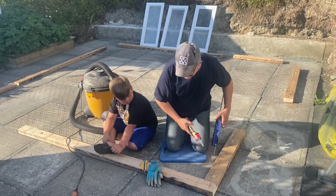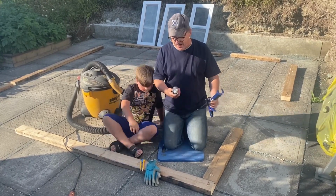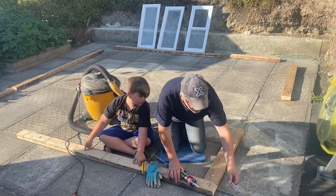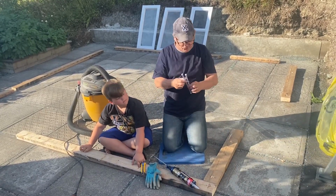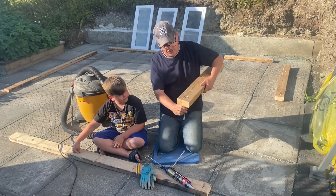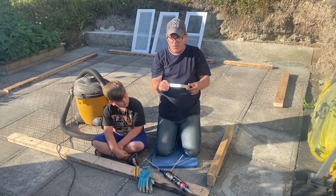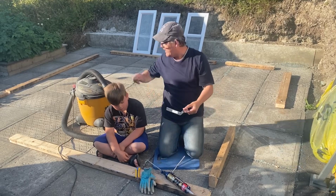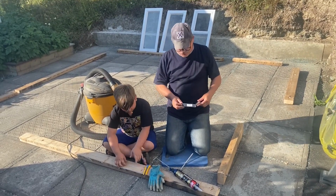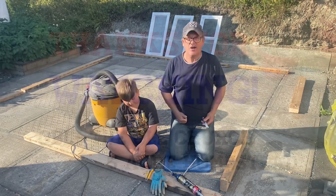To secure this rough 2x4 to the patio stones, we are using a caulking gun with PL Premium. We're also going to use 8-inch lag bolts. That's right. So we're also going to put the 8-inch lag bolts down through these. We've got it countersunk. We also have these L brackets, and we're going to be securing these in each of the 4 corners in our kitchen. It's going to be a very strong outdoor kitchen. Ain't that right, James? Yes. Awesome. All good? There you go.